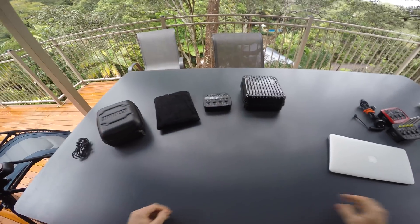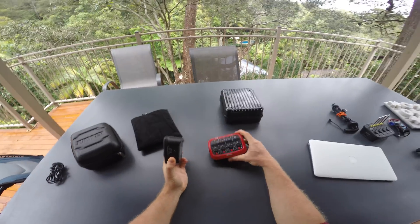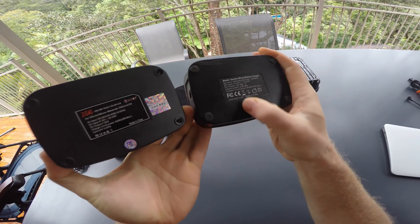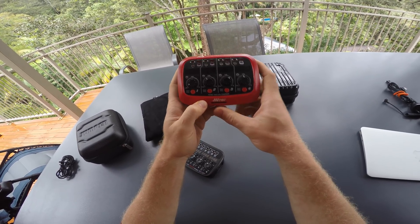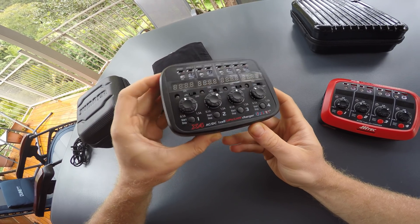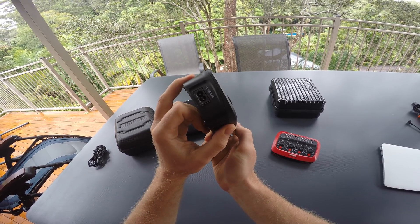Now there are lots of different ways to charge single-cell lithium batteries. This charger here is one of the easiest ways I have found. It's made by SKYRC — the same company that makes these high-tech X4 microchargers, just branded a little differently as HTRC instead of high-tech. I have been using a stack of these red chargers for a long time and they've been doing a great job, however they only charge batteries up to 4.2 volts. This charger works exactly the same but has a little switch on each channel to select between 4.2 and 4.35 volts. Maximum charging current has been increased to 1.5 amps. You can power this charger either with 12 volts or straight from the grid at 100 to 240 volts.